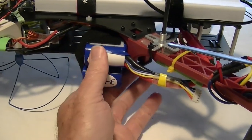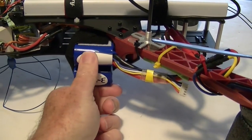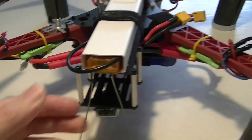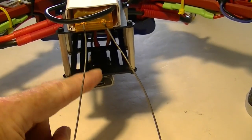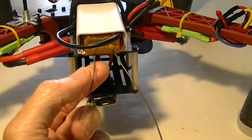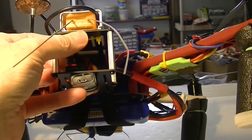I now have two batteries in parallel on the bottom. I may give another battery a try — it's a 6000; these are two 3000 mAh 4-cell packs, and I'm going to try 6000. The antenna is still on the bottom. Still using the same Orange RX 8-channel receiver on the back. The LED module used to be up here underneath the receiver, and I think it was causing interference with the receiver and making the modes change for my screen. So I gave myself some separation and put the LED module on the bottom of the quadcopter.